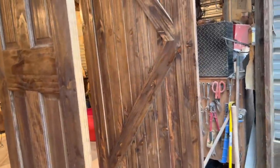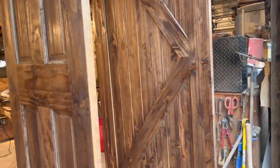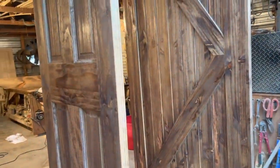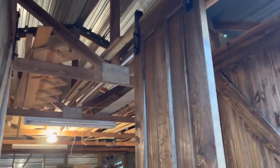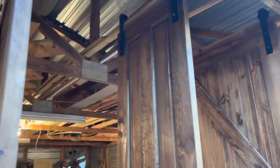It's sort of blue colored when you spray it on, but it dries clear and it doesn't yellow like the old oil-based polyurethane used to turn yellow. This right here stays crystal clear. So hang in there. I'm gonna lightly sand it in just a little bit when they dry out and then put another coat on.